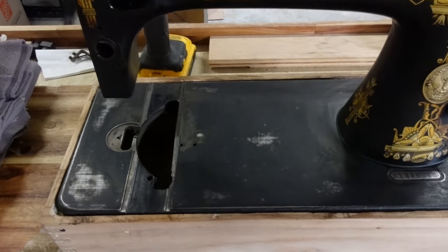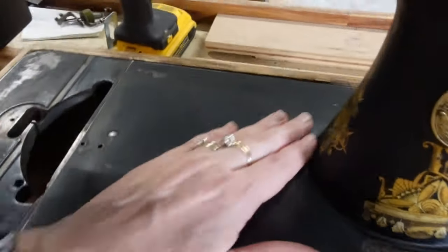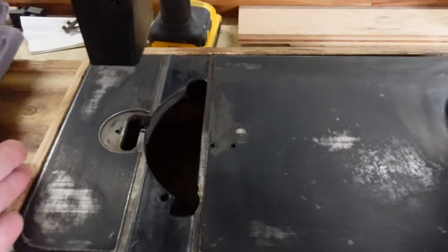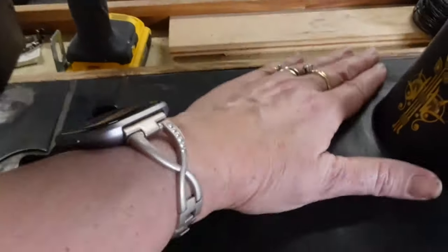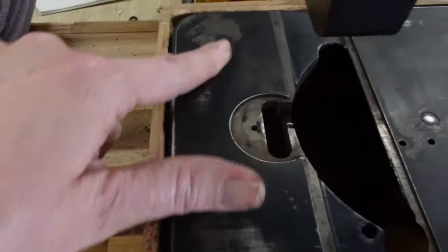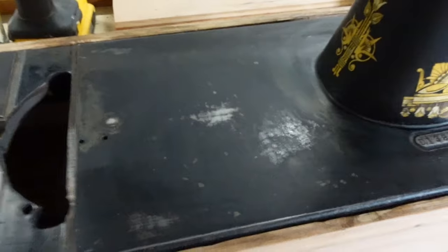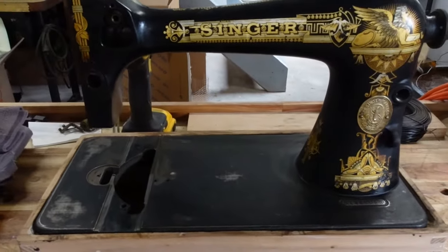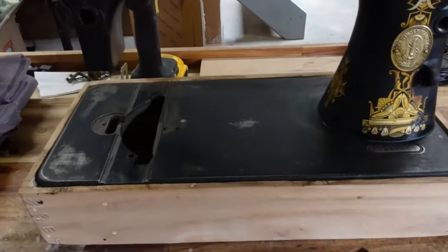It actually didn't take very long, so I am going to let this rest for a couple of days just in case there's any gassing off that's happening because of the solvent I used to clean with. I have sanded it down with a couple of different grits of sandpaper — you can see there are spots where you can see bare metal. That's just the nature of the beast, but my paint is going to cover that up. So let me give it a few days to rest, and then we'll come back and mask off the entire top section so that all of this stays nice and protected, and start painting the base.